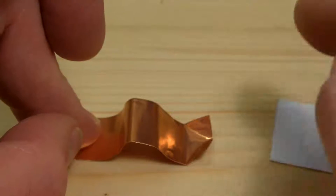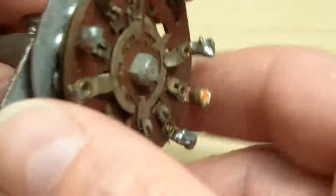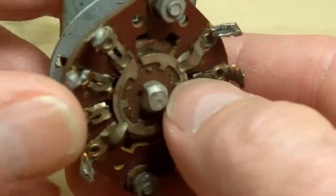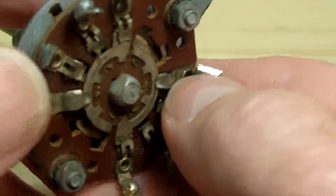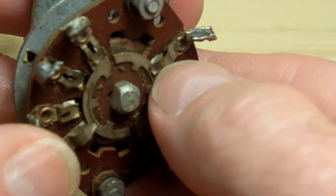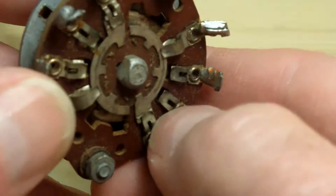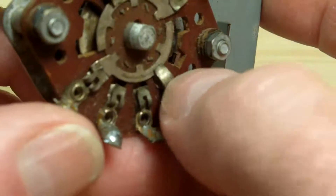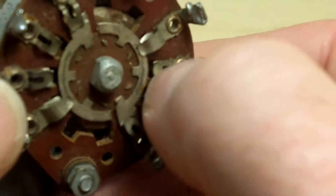So it's just a way I've been able to resurrect a switch that otherwise is useless. Incidentally, contact pressure is of more use than large contact surface area. On modern circuit breakers and contactors, the area of contact is relatively small compared to what it was many years ago, but the pressure is much higher. In a miniature circuit breaker you'll see very small contacts providing a lot of pressure. These little contacts will never pass a lot of current, but if they haven't got enough pressure they won't be any good.